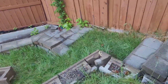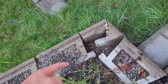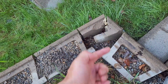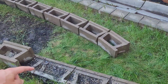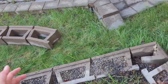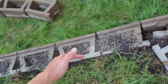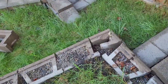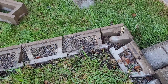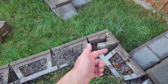I'm trying to memorize how these corners were made, because the reason they made a little gap — or purposely opened up the gap on the side — is so there's a slope gradually going this way. All the gravel is supposed to allow water to flow inside the bricks and then drain through this way. This is the discharge of the entire retaining wall. When I rebuild it, it's going to have a similar design and function, with an opening on this side for the gravel entrance.